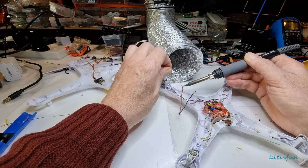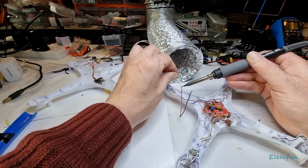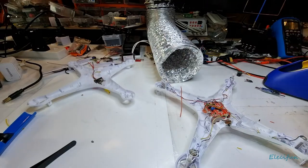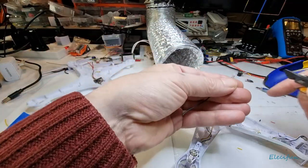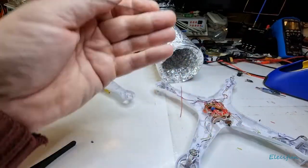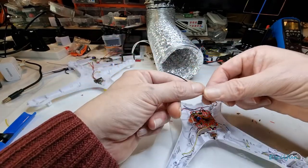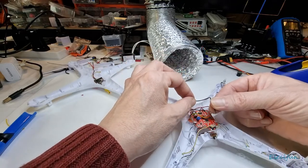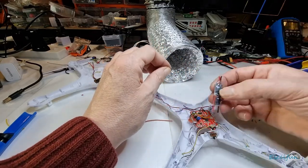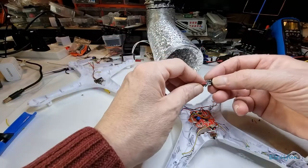Now we've got the wires — let's make sure we've got the ends cleaned up. We want the input of the boost converter to have the output of the LC filter feeding it. I'm going to chop that down to a more equal length. So we've got 'in' and 'ground' — those two pads on here. One of the nice things about silicone wire is you can just use your thumbnail to strip it.